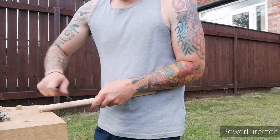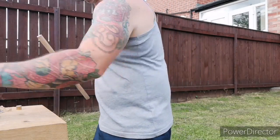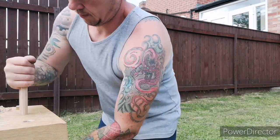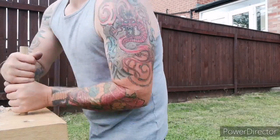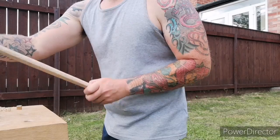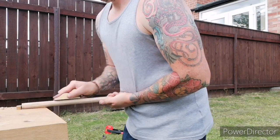For final adjustment I just start to use a card scraper. You could use a chair devil if you've got one — I haven't got one and I haven't made one. As you can see it's still pretty tight. The reason I'm forcing it down here is because it actually bruises the dowel and I'm able to see where I need to take material off with the card scraper. As you can see, I need to take a little bit more off the top side.